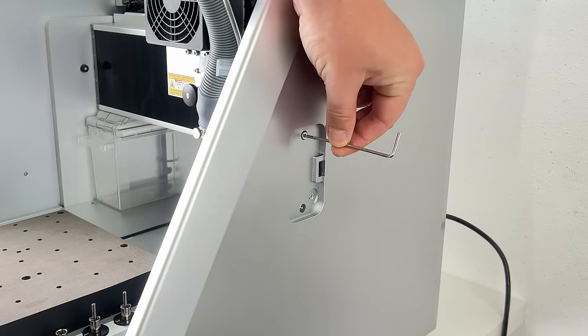With the chamfering done, the first side milling was complete. The second side — cutting out the part — setup is mostly like side one. I set a new work origin with a flip set axis, added 2D pockets for lightweight, another face operation to reach 4mm thickness, and chamfering of the already-machined holes and pockets. Simulations looked good, program exported, uploaded to the machine — setup was a no-brainer as offsets were set in CAM.